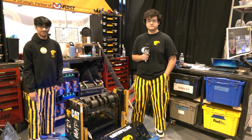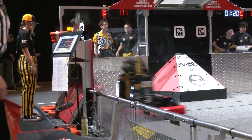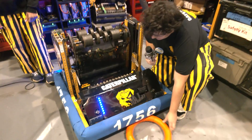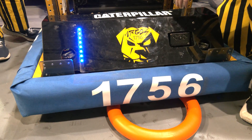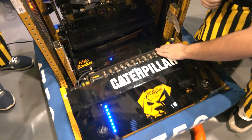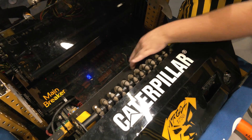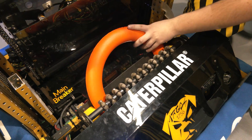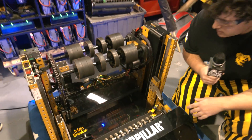Logan, let's talk about the overall mechanical aspect of this robot. You have so many great things going on — talk to me about that full note journey from intake into your shooter and how it all works. Following the note journey, it starts here with an under-the-bumper ground intake with a lot of iterations. What we came out with is Omni wheels, which works best because we funnel from left to right. The note can move left to right with these 3D-printed wedges that basically funnel it into the center so it can only be in one position once it comes out.